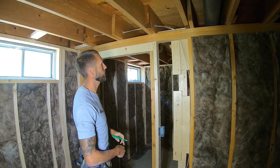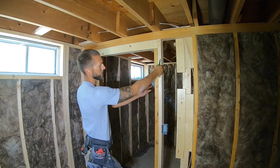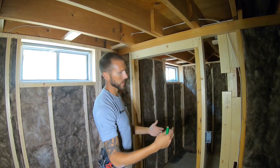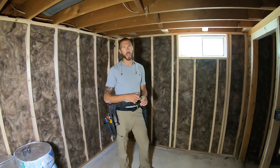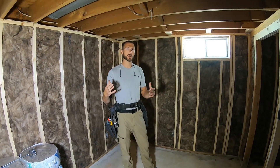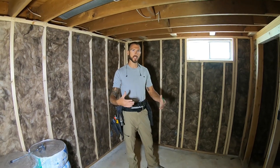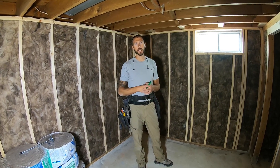Whatever terminology you use, basically what the jack does is hold up your header, and then you secure your trimmer to your king stud. The king stud and top plate give you the surface to nail your trim to, attach your drywall to, and space your electrical box. Thanks for watching — we tried to cover some of the more basic things for beginners and homeowners. We have a more detailed series coming out covering every aspect of this basement finish, with more detailed info for trades as well. Thanks for watching and keep hammering.